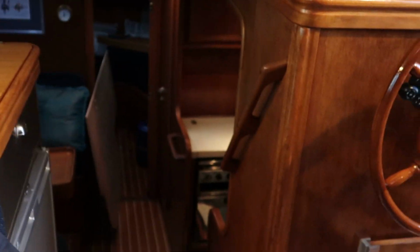So I am going to leave all these floors exposed for now. Leave my floors where they are down here, because I am going to have to investigate the tube heaters that are in the engine room. They're definitely not warming up, so because of that, I don't want to risk any. I like to keep the engines warm. They should always be warm. Just a little bit, but warm. So that was just a quick rundown of what I've done to make the boat good for winter.